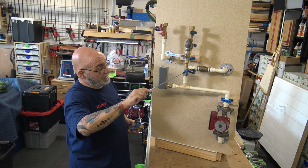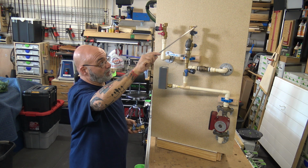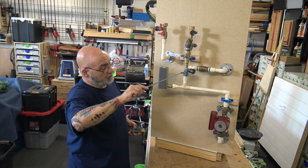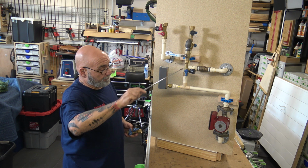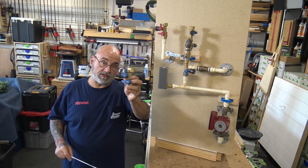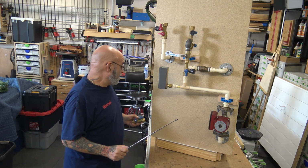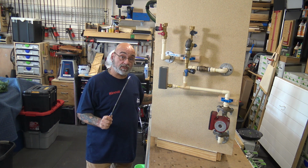comes with this T. So it comes with this part right here. This was the cold water inlet with the flush, and it comes with this piece right here, which has a check valve built in and a bleeder valve. So you would forego using this on the tankless, or remove it if you have one already installed, and put this on. Now, this is made, excuse me, for a dedicated, we'll go over this once.